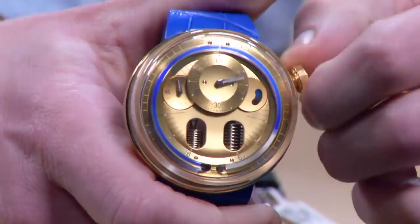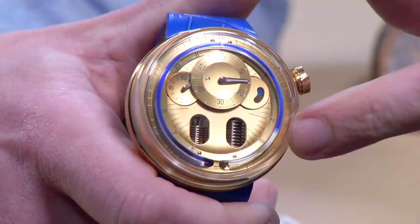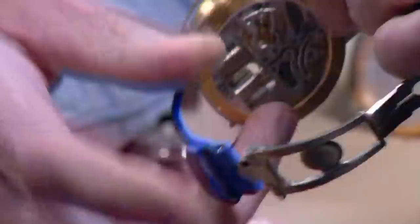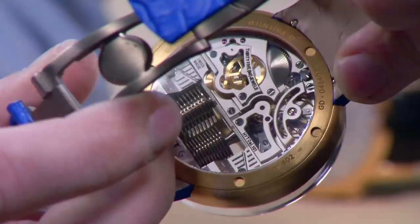It's a very cool system where there are actually two bellows internally, and radially you can see that meniscus, the clear and the blue liquid, and as they approach the end of the 12-hour cycle, it retrogrades with actually kind of surprising speed back to zero. All of this is driven by a pumping system on the case back, and you can see that it is traditional mechanical watchmaking. There is a traditional heartbeat and Swiss lever escapement pushing those two bellows, one full of blue liquid, one full of clear. So those guys are very cool.